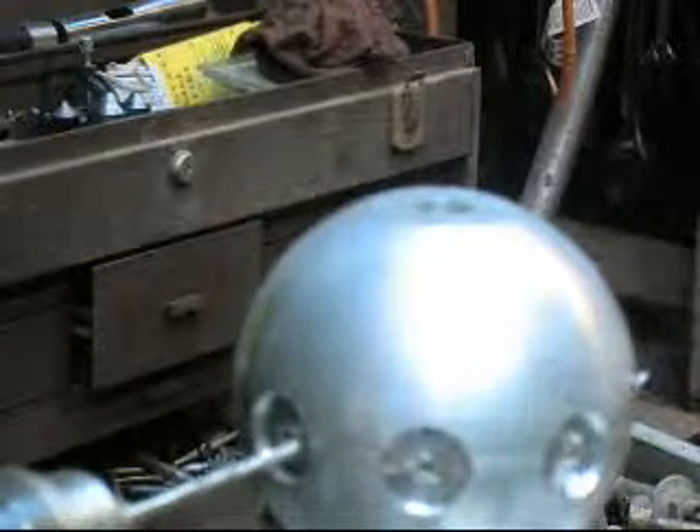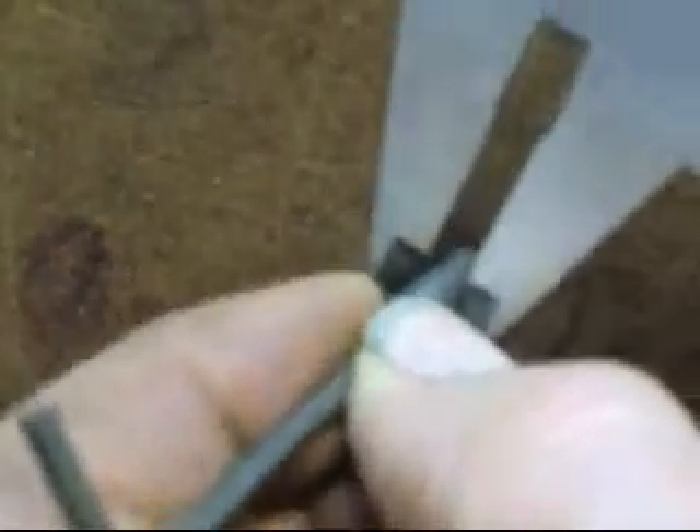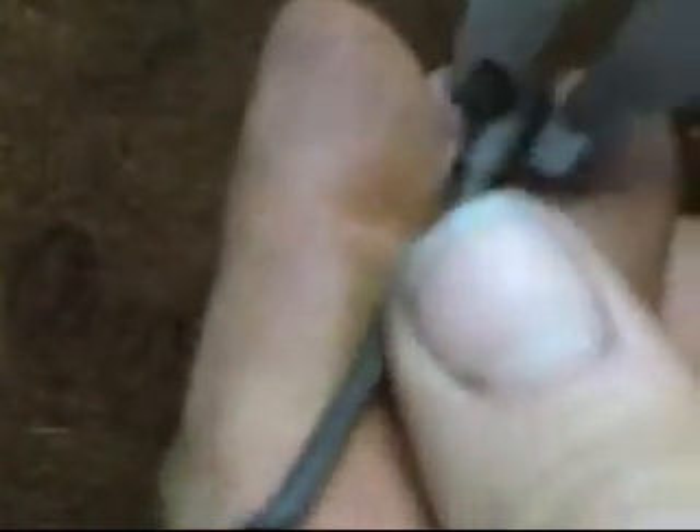I'm going to have to center drill this first. We're cutting a hole in the sphere all the way to the center core, and now we're going to set a set screw in there. But first we've got to figure out what our size is. Sometimes I'll take measurements and figure out what the thread is, but other times I'll just take my vernier calipers, go in between the threads, grab it fairly tight, lock it down, and pull that out — and that's pretty much my minor diameter of the threads. If I'm doing a real tight thing I do all the calculations, but in this case it's just a set screw that's not going to be cranked down that hard.